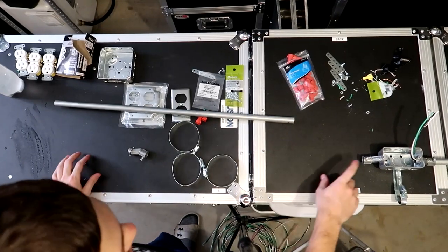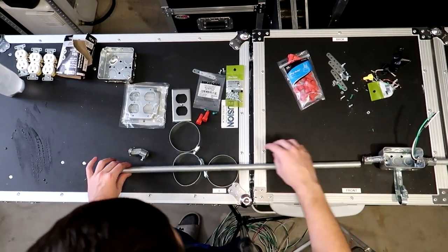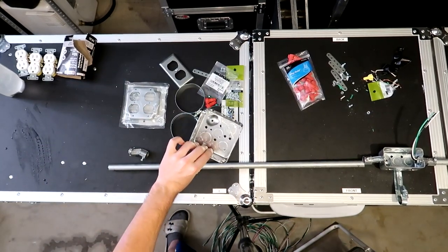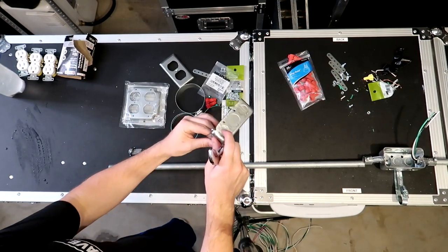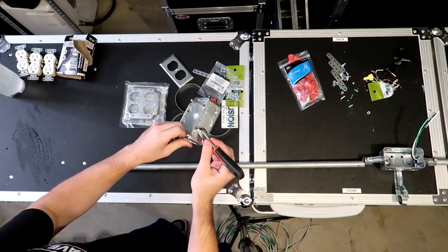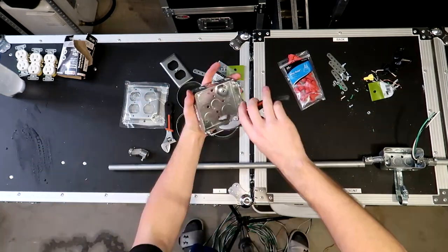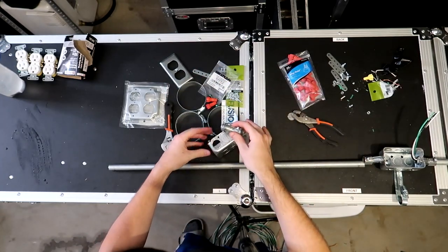All right, so before I actually start wiring up this box right here, I like to go ahead and assemble this whole entire upper section. So to do that, we're gonna need our other box right here, the other quad box. For this, we only need to basically knock out the one thing right here at the bottom. We only need one, so we'll knock that out. Use our pliers to pull it out again. Put in our half inch offset.